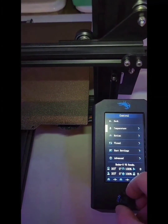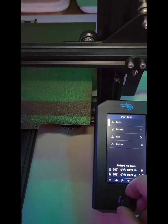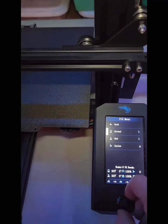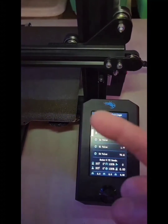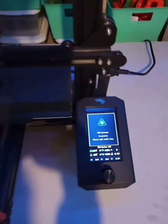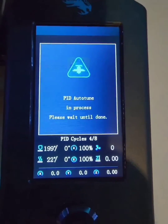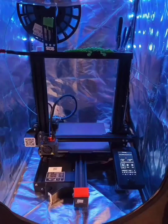We're going to go to Control, Temperature, and PID. Change the cycles to 8. I'm PID tuning this because I put in a 50 watt heater. I just figured nobody wanted to watch the whole PID auto tune. We're at 4 of 8 cycles. This does heat fast.